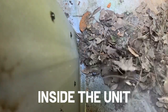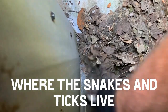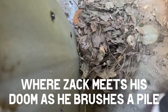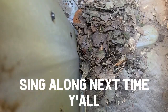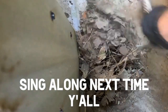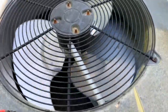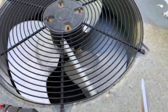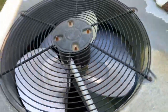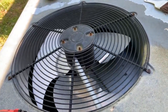Inside the unit where the snakes and ticks live. It's fall, everybody — jump in the leaves. Good tip: after you put the fan blade back in, spin it to make sure you're not hitting anything, just to make sure you don't have a surprise when you start the unit back up. That'd be bad — that's what we call bad in the trade.